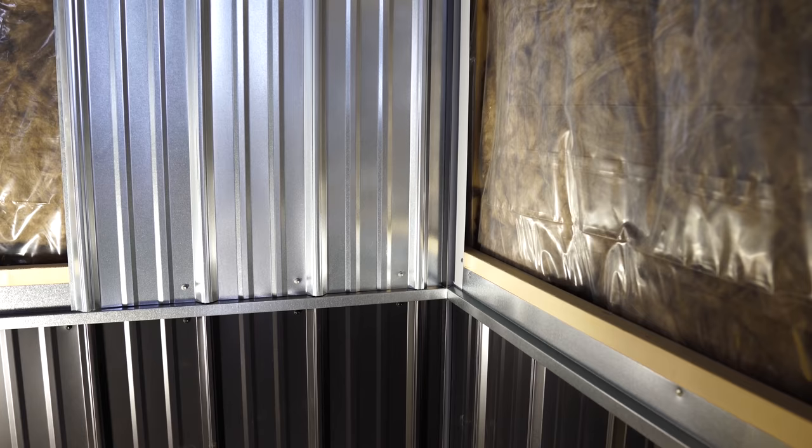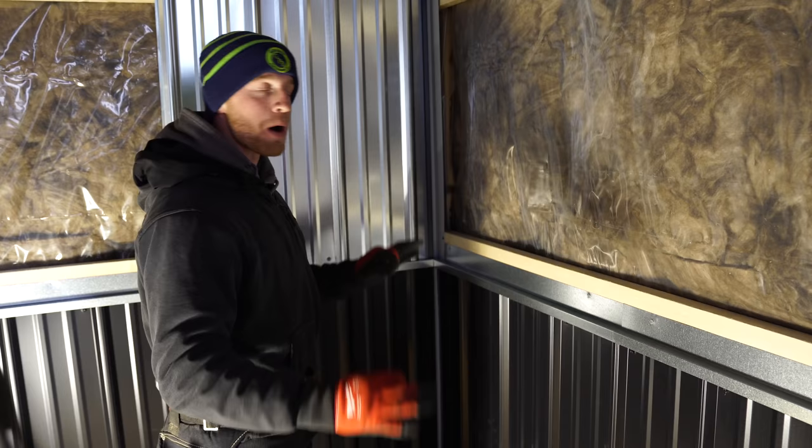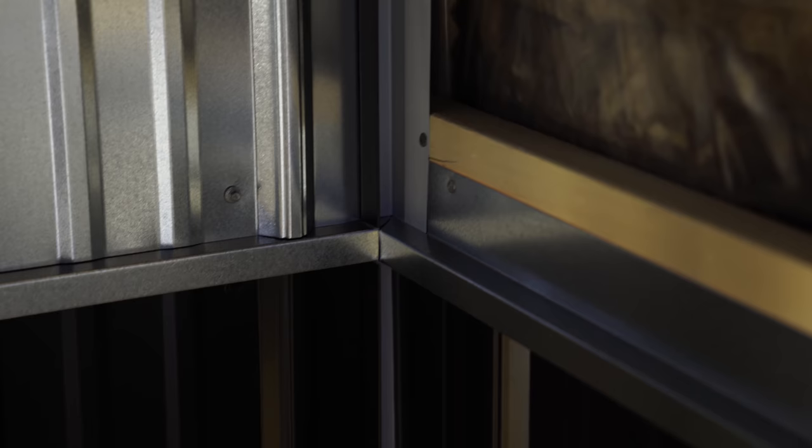Okay, so we ran this sidewall steel into this corner. Well, let's start first with the framing though. We got our end wall framing. Anyways, so we got a corner board going up that's the width of these end wall posts. So that way these girts run through that and get tacked to that. And then our sidewall will run right into there. And then it'll line up with that corner board so you know it's money. And then we shot our base trim out with the laser. And I'm pretty sure Kyle showed you that corner bend down there.